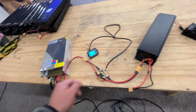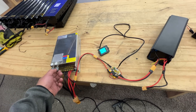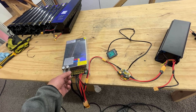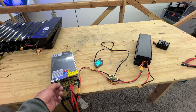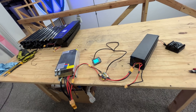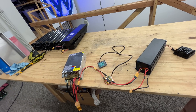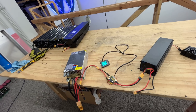Our website says eight amps — that's the info we found and put in there. Let's try six amps... seven amps... eight amps. Okay, so it is charging at eight amps. Let's leave that for a while and see what happens — if nothing overheats and the BMS doesn't quit, that means you can charge continuously at eight amps.